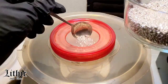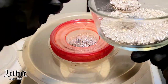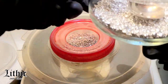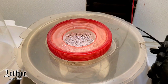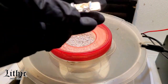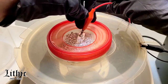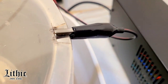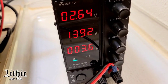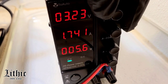Really what I'm doing is there are just tiny amounts of impurities in this four nines fine silver, and I'm going to run it through this silver cell and capture as much of that as possible. This pure silver crystal is just extra special. I've got a little bar I'm going to use to attach the clip for the positive — that is our anode. The negative is connected to the bowl, our cathode. I'll turn on the power supply and adjust the voltage to under 3.5 volts.